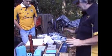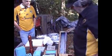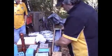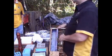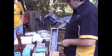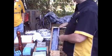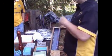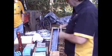The other way, if you're cheap and nasty, look, Melamine works a treat as a mould. This one's just glued together with hot melt glue, and this is actually one I'm going to do this afternoon, which is a pepper grinder blank. These are too big to put in the pressure pot, so it's a matter of trying to use vibration as much as you can in thin resins, but you do multi-layer casting, and what happens as it shrinks, the next pour you do fills the cracks and shrink holes and keeps going. But I'll show you that this afternoon.